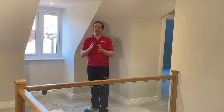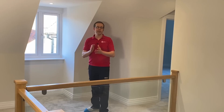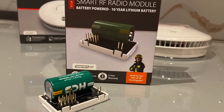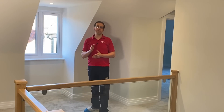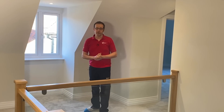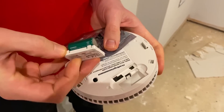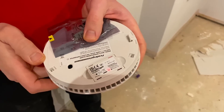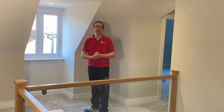Now you can imagine the harm that could develop by having a conductor connected between two separate circuits that occasionally went live when an alarm was triggered — it'd be worse than having a borrowed neutral. However there is an exception to this rule, and that's if you're using one of these clever little devices like this one from Fire Angel. It's a smart RF radio module and it allows the detectors to communicate with each other wirelessly. You'll still need a mains supply to each detector, but these could all be wired off of different circuits. Then you simply clip this module into the back of the detector and install as usual. If a detector is triggered, the radio module will wirelessly send a message to the other detectors that are paired up in the property and they'll all be sounded.